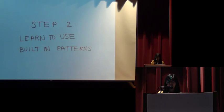And even though this was something that was already built into the machine and not any of our own functionality, it felt like the next level of difficulty in machine knitting. It required another 10 pages of the manual. It required a bunch of steps to set up that you didn't have to do previously. And just to illustrate how non-trivial this step was, on the left is our first attempt to knit a built-in pattern, and on the right is our first successful attempt a couple hours later. The first failures were a result of pushing the wrong settings, having the wrong width of yarn, and accidentally using every other needle instead of every needle.